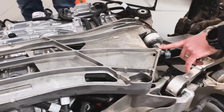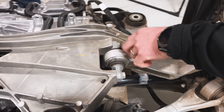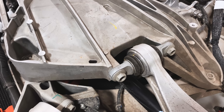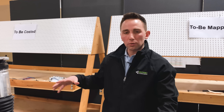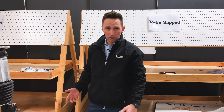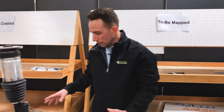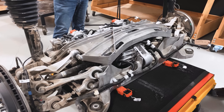This 5000 series die-cast piece has taken up the job of managing their upper camber link — they're mounting their camber link directly into that upper casting. There's something we refer to in dynamics when looking at a CAE model called torsional hoops. By creating this giant hoop around the powertrain, it really helps you manage all of the torque generated via the powertrain, as well as the suspension input loads side to side and in jounce and rebound. This architecture on the entire rear subframe is going to be extremely rigid and allow you to tune your suspension really well.